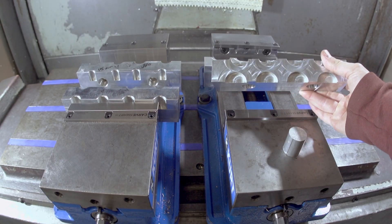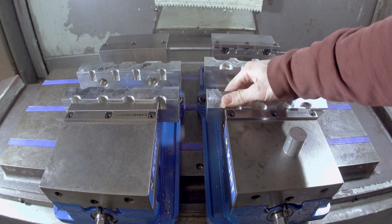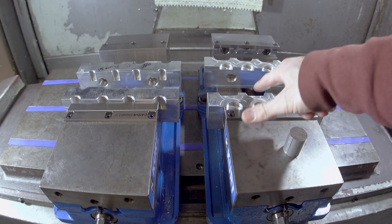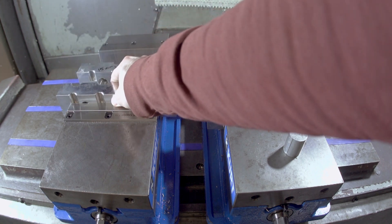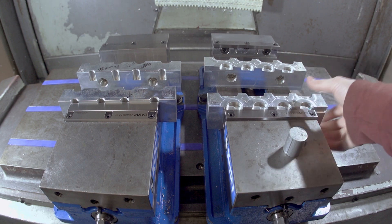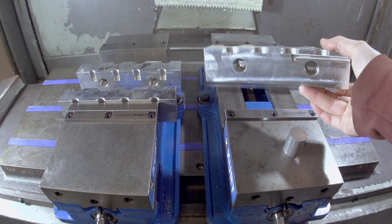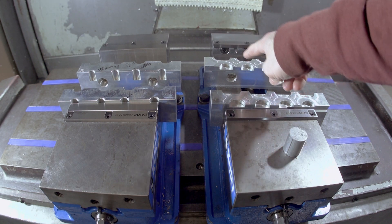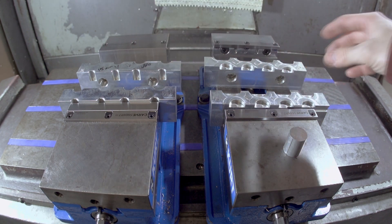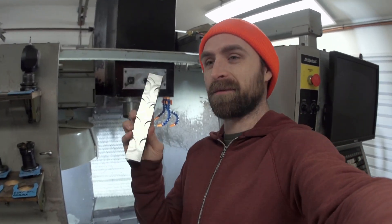When I was done machining 15 millimeter collars, I would take the bolts out, flip these around, and these are the pockets for the 20 millimeter collars — a different size stock and of course a different finished size. At the time I thought that was pretty slick because I'm using the same piece of material to make two different parts — efficient for soft jaw use. I'm holding four pieces at a time in each vice, so I'm holding eight pieces at once. I had three different parts to make, but I didn't want three different fixtures. I wanted one set of fixtures to make all the parts for the truer skewer.